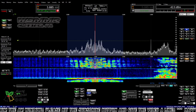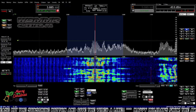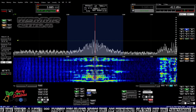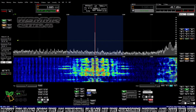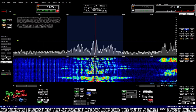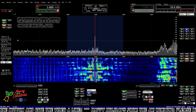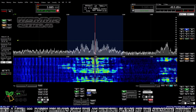Maybe you could copy the wires over. I'd love to have somebody else model it, especially with the feed lines. I've got to read up on it — I just haven't taken the time to go through that tutorial on feed lines, and that's a real critical part of this. On top of which, real ground versus theoretical plays a big part, and that's a variant that's very hard to measure. You've got to take this with a grain of salt. Mark and I did some testing and it's pretty much in the near field as predicted. The models, if you build them properly, should mimic almost anything you put out. I've put stuff in the near field to see if it interacted — it's a huge difference. You've got to be careful with anything like this that you don't have anything in the near field broadside.